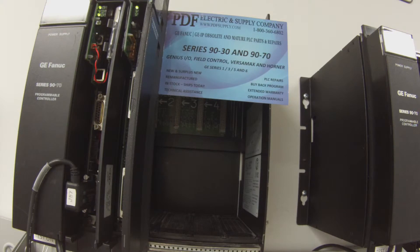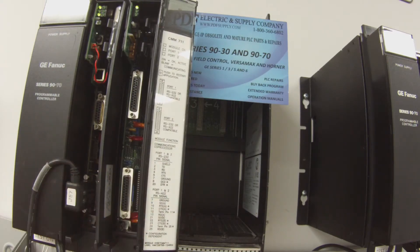TestCom is for GE FANUC PLC communications testing. On the bottom left-hand side, I'm going to go to a CCM type protocol. What this does is kind of like pinging an ethernet — there's a signal exchange between this software and the computer and the CMM. In order to get that signal over the CMM, I'm going to be using this shielded cable.